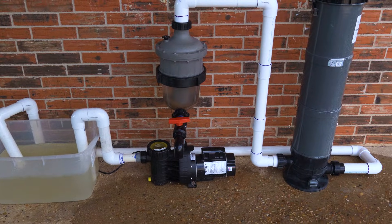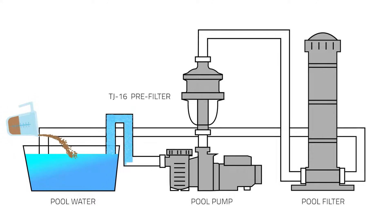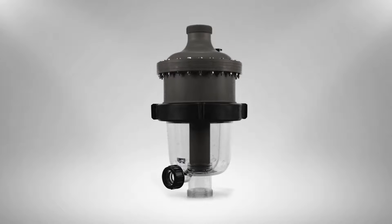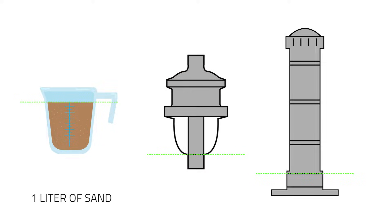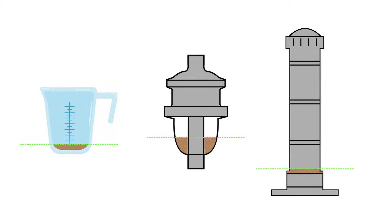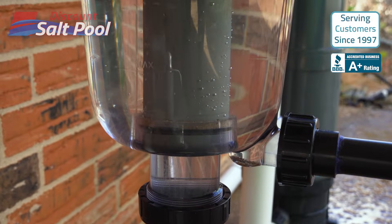So we could run the pre-filter in a more controlled setting, we created our own equipment test pad with circulating water. As you can see, the water comes from this tub — this is going to simulate your pool. You will also notice the basic equipment such as your pump and filter, and of course the component we are testing today, which is the TJ16 pre-filter. What we will do is pour about 1 liter of sand into the circulation system of the test pad and try to measure roughly how much gets collected before reaching your main filter. We will document this whole event with multiple cameras, some of which are actually inside the different pieces of equipment.